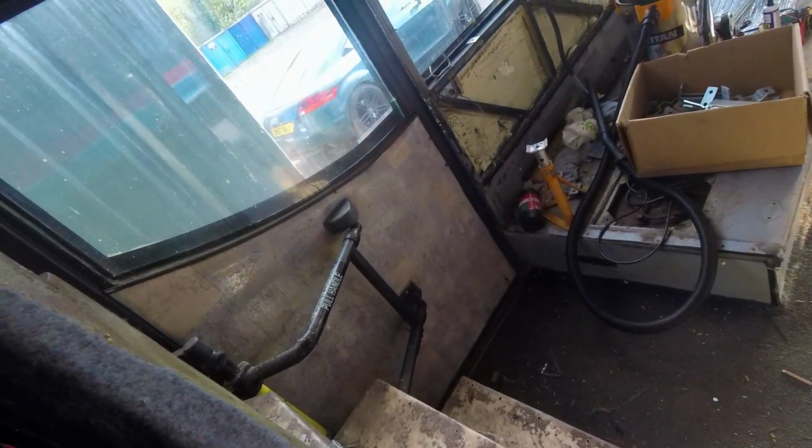So the door is obviously also actuated by the air. As long as you've got air pressure, you can open and close the door. But as soon as the engine is stopped and there's a leak down with the air pressure, and because there is a leak in one of the air cylinders, that air pressure drops within a few minutes and the door no longer locks and seals, the same as the cargo bay doors.